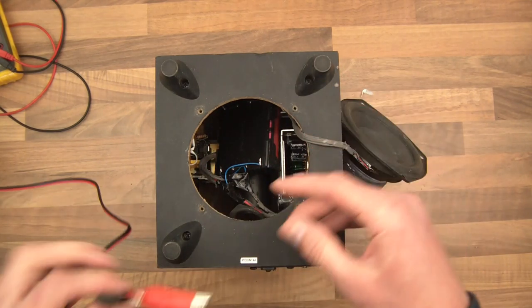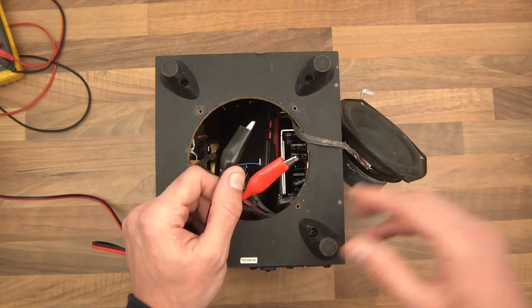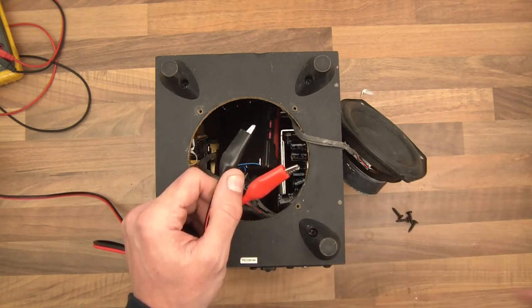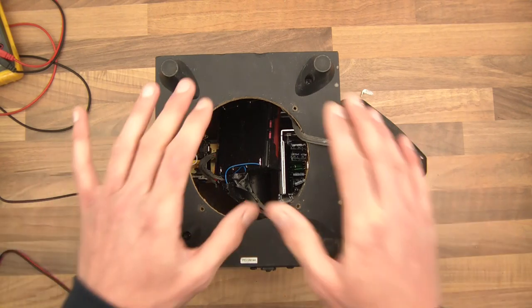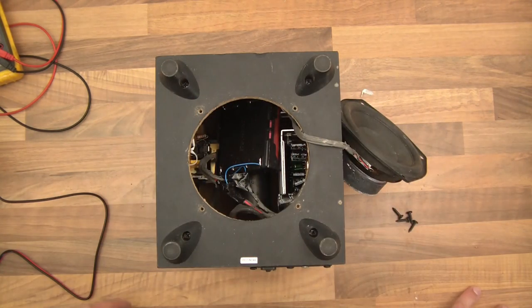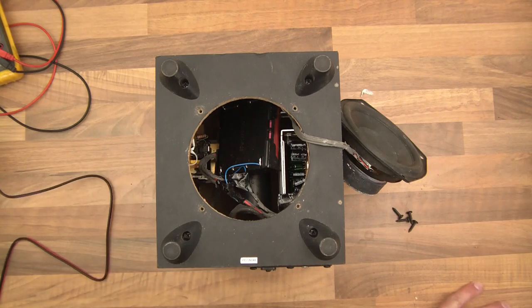I thought, what sort of battery chemistry could I use? I forgot about the power unit and powered the motherboard directly — the other side of the cable — giving it 16.5 volts, and it worked fine. I then tried different voltage ranges and discovered it could go right down to 10 volts and still work. So I could have put a 12-volt lead acid battery in there — that would work — but they're really heavy. So I thought: how about lithium?